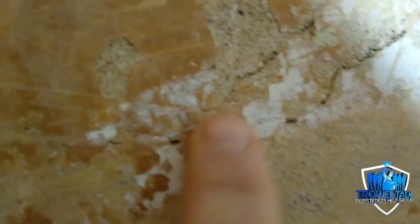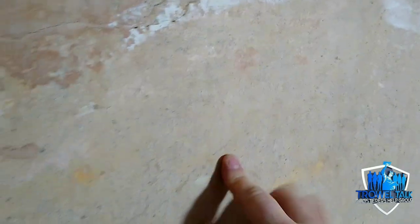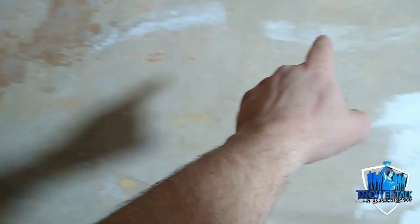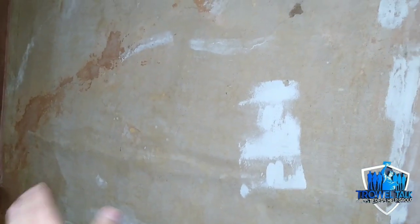There are some hairline cracks here that have been filled in previously by the owner with filler, but when you tap the wall it sounds quite dense, so these cracks are actually superficial. This is a sand and cement mixture — the original plaster. Most of the walls have a few stress cracks running through and have been patched up with gypsum or poly filler over the years, but overall they're nice and plumb and sound. That means we can scrape them back, take off any loose paint and skin plaster, prime it, then mesh and skim.